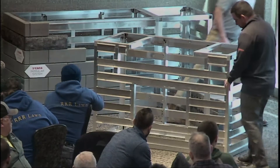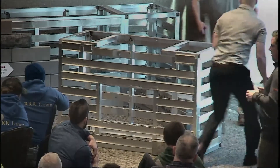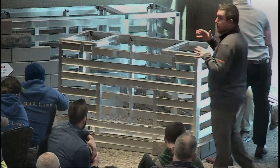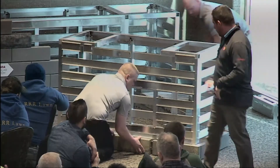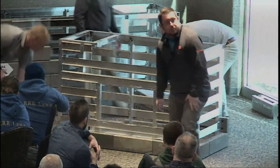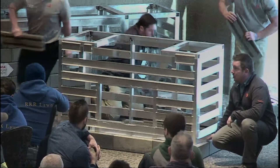We're going to start hanging our panels, beginning with the rights on this end. When we package the corner panels, we package rights and lefts on the same layer — there are four rights and three lefts per pallet for corner panels. We always encourage you to start with the rights first because you have more rights than lefts. So you'll go right, left all the way up and end with a right on top, using the product efficiently with very little waste. Starting with a right on the bottom and then the half corner gives you the half-brick offset.